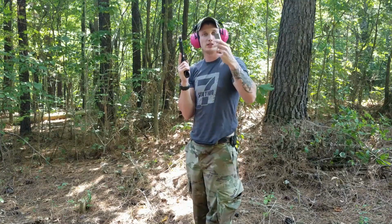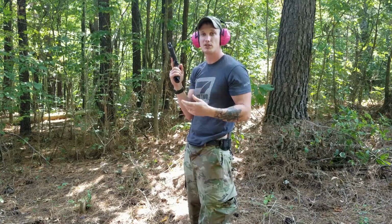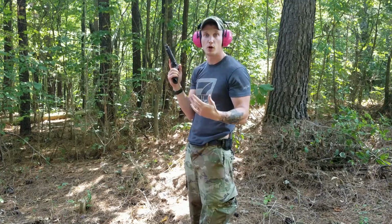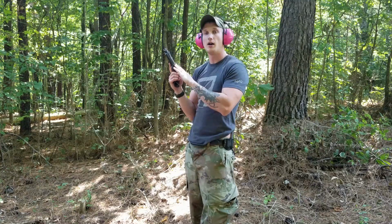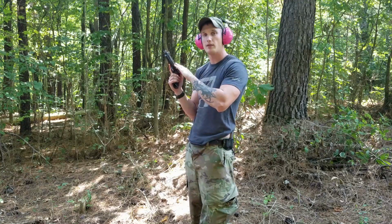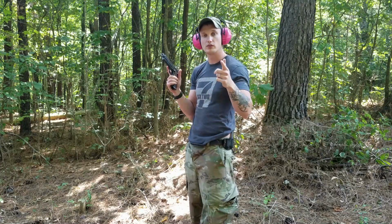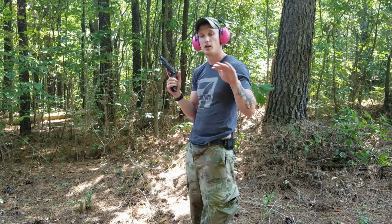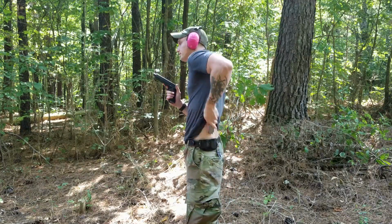That's our first magazine, two-handed. Now we have to do a second magazine, one-handed, and we have to still get perfect extraction. If it passes this test, we do have acceptable extraction with the new extractor. The old extractor did have acceptable extraction when it was new from the factory from Sig. Obviously, that's worn out. So, let's see.